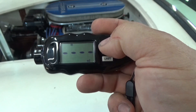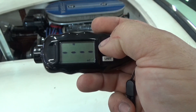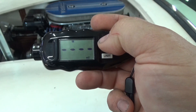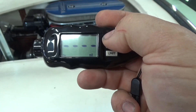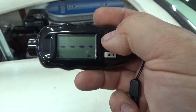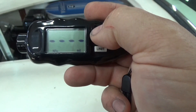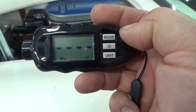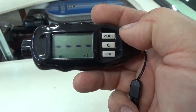The next mode is M, which gives you more detailed and precise information about the measurement results. And there's P, which displays the results table for calibration — I'll talk about calibration in a second. Then there's FE, which is for steel-based or iron-based substrates, and non-FE for non-iron substrates. Let's go ahead and use this thing — I'll show you how easy it is to use on some steel and some aluminum.